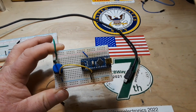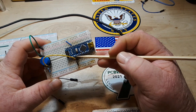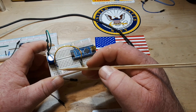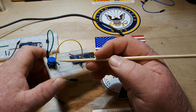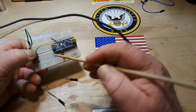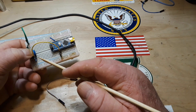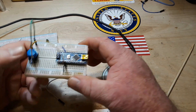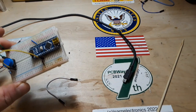During normal operation the Arduino is watching that pin — and if we follow the wire over, that pin is currently grounded. So the Arduino is always going to see a zero on that pin because of that 10k resistor. Why a 10k? It's a medium bit of resistance. When you press the button, the voltage comes across through the switch, and because there is less resistance in the wire going to pin two than going to ground, you're not going to short out the switch — you're simply going to energize pin two. That's a pull-down resistor: when the switch is not pressed, it pulls that pin down to zero volts, but when you press the switch it's energized at five volts.